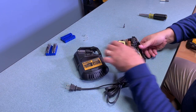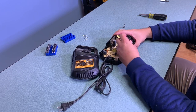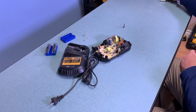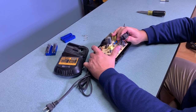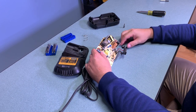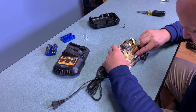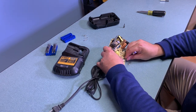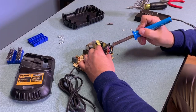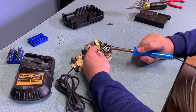The hole for the screws is quite deep so I wasn't able to use the bit holder that came with the set, but I was able to stick the bit in and use the screwdriver behind it to loosen and extract the screws. Only four screws and the lid pops off. The actual hardware with the pins on it is quite small — it isn't screwed on, it just sits on two posts. Simply pry the one clip away and the whole board assembly, cord and everything, comes out of the interior of the charger. The only thing we're going to need is those pins that connect to the actual battery terminals. I tried to remove the connector that looks like it's attached there, but no matter how hard I pried and lifted and pulled, it's actually soldered on — there's no removable connector.